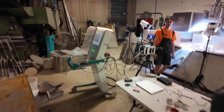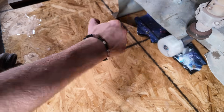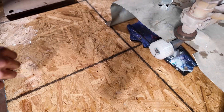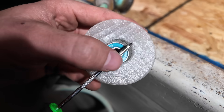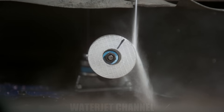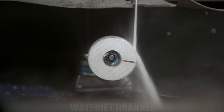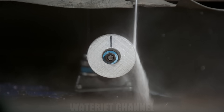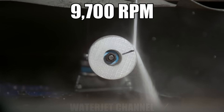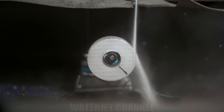The 3D printed wheel is too weak to survive spinning this fast. The bearings are intact but the wheel is completely warped — there's a massive gap where I can fit a pick between the wheel and the bearing. Doing the math with the camera frame rates, we can determine it was spinning at 9,700 RPM. That's no joke even if it didn't explode. A little lame, but I'm terrified for the next ones.